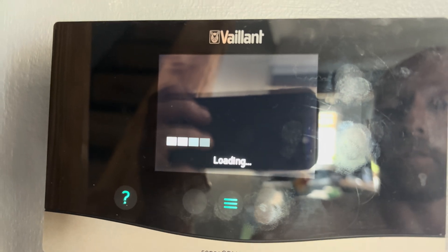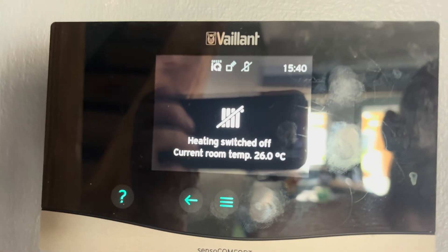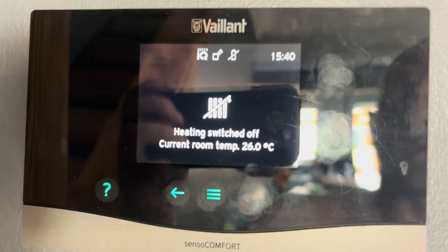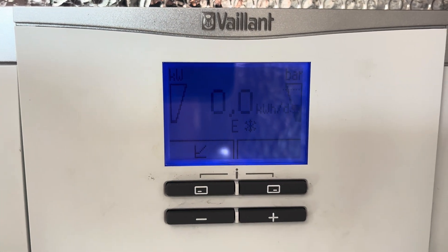Go in, set mode to manual, and cooling is now activated. It should come on very soon — we're looking for about 15 degrees C in here. Cooling works particularly well with fan coils or through MVHR. It's not so great with radiators as it will condensate a lot, but it does work with underfloor heating as well.